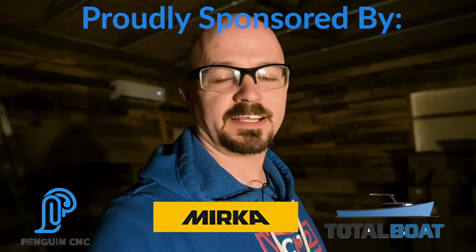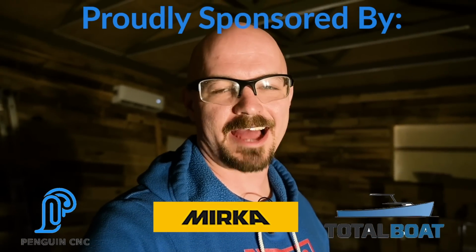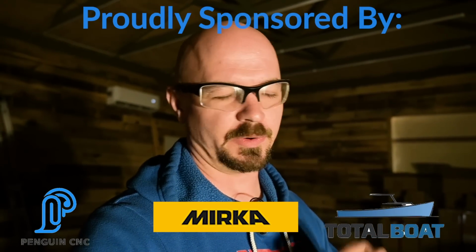Got all the floor mats down here. Now, when I did the slab, some of you might have noticed in that video, that it didn't do a great job flattening because I didn't leave myself a way to screed it. So I ended up adding some more concrete in the really low spots. And now we need to use some self-leveler to level it out a little bit more. Then we can get to laying down the tiles. And I really need to get the light situation in here going a little better.